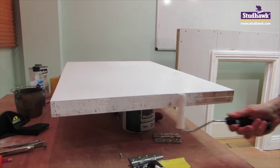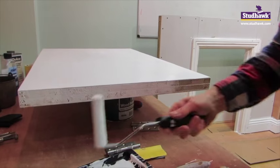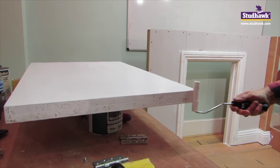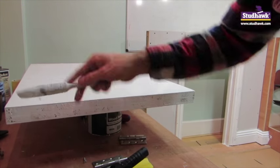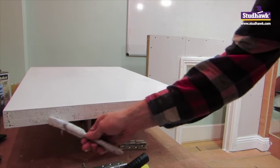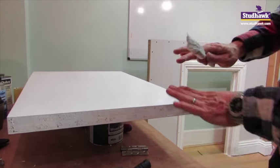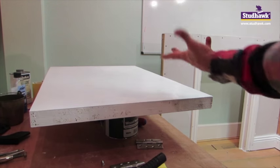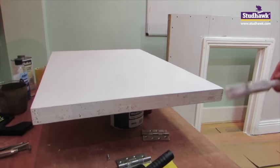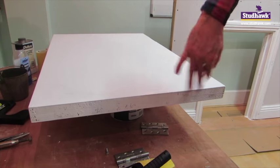The pile of the roller helps get into that rough timber. We're going to sand further, coat up further, and perhaps give a little bit of two-pack filler — not a powder filler, but a two-pack filler. Make sure you haven't got a run there, or a run underneath. Repeat it around all four sides — that's your first coat with your primer. When it's dry tomorrow, turn it over, give this side and the edges another coat, because these edges are going to need quite a bit of paint. Sanding in between — that's it for now. Tomorrow we'll tell you about fillers: powdered filler versus two-pack.